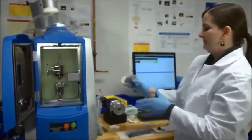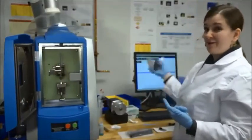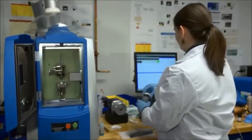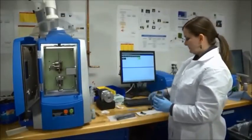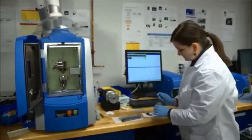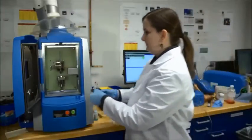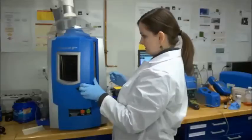I'm going to take my oil sample and shake it vigorously. You want to do this for about 30 seconds. Then I'll use a sample cap, put it in the sample cup holder, and fill the cap until it's completely level. With the sample ready, put it in the sample stand, then lift it onto the disc and shut the door.